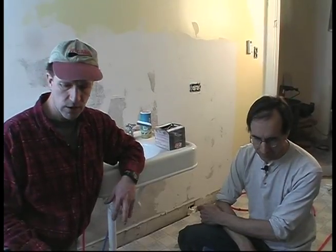Mm-hmm. So we're going to put some nails in the floor here and there, about every 3 or 4 feet. We like to find in a leveling job the highest point in the room, and then we'll add a minimum 3/4 inch for our minimum coverage to that high point. Okay. Then we'll use that high point to set our grade with the nails and pins everywhere else, usually about every 4 feet if we have a nail or a pin. Mm-hmm. Every 4 feet, that's enough for us to get it to be level. Okay, so what do we do?